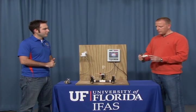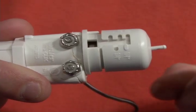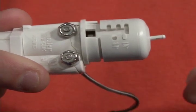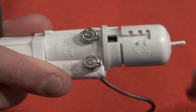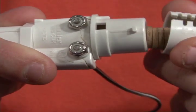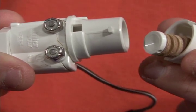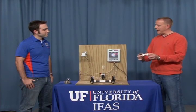How do you make sure these things are working? Do they require any maintenance? This expanding disk sensor — you can check the switch to see if it's functional by simply pressing the little post on the top, and it should cut the irrigation off if the irrigation is running at that time. The disks should be checked every few years, and if the system seems not to be responding to rainfall properly, it's easy to just replace the whole cap with the disks every few years.